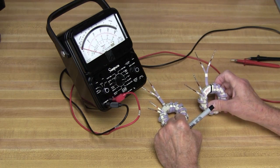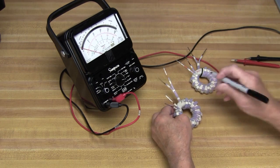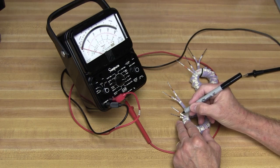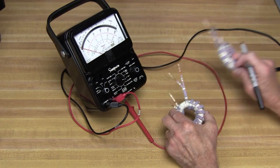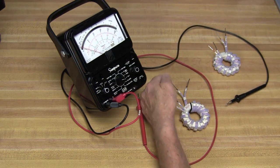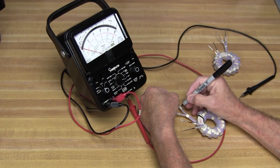We want to keep these as straight and parallel as possible. Now we've got both transmission lines ready to go. We're going to wind the first toroid, leaving about an inch and a half free on one end, spacing as tightly as we can. I'll put a tie wrap around the first end to keep it from sliding. I've got both toroids wound — now it's time to identify the leads. We'll mark them 1, 2, 3, and 4 on the first toroid, then pick up with 5, 6, 7, and 8 on the second toroid.